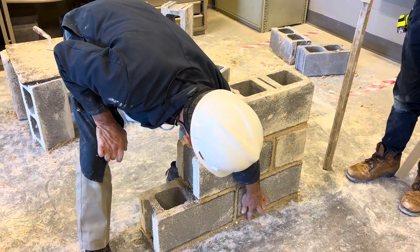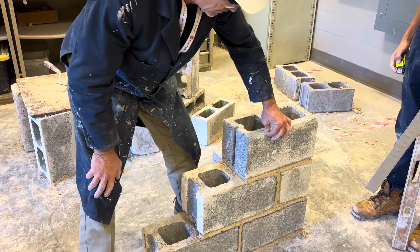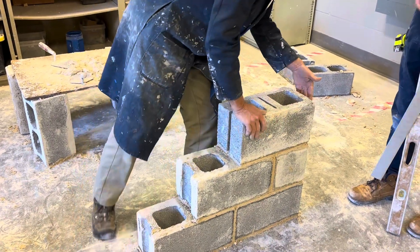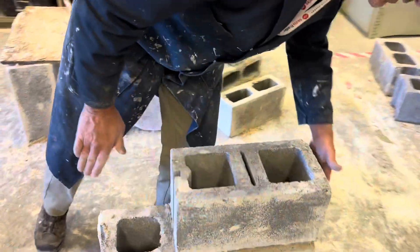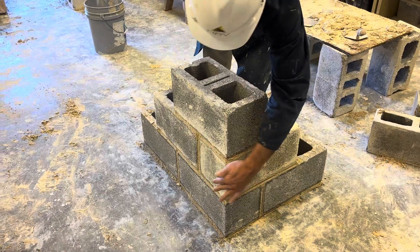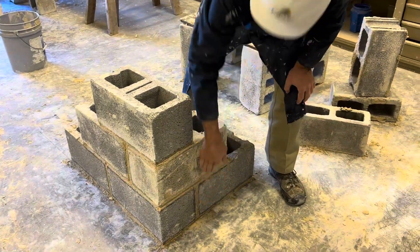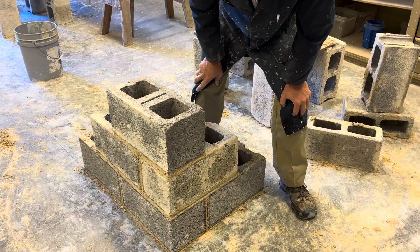When you're done, from here to the top it should be 24 inches tall. It should be arranged with a corner block — if you look here, we're not using a stretcher block, it's a corner block, a corner block, and a corner block, so that we're creating what we refer to as a common bond on our corner.